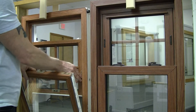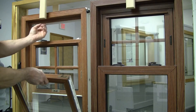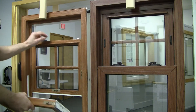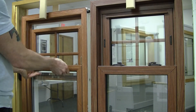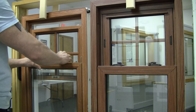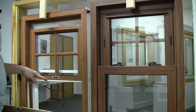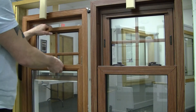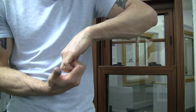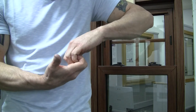Now, this window has six pieces of weather stripping. There's one piece up here but nothing on top. You have a little weather stripping on the sides, and at the bottom underneath you have one rubber bulb strip. One of the big mistakes — where they went cheap on this window — is there's no interlock where the two windows meet. When you have windows shut on a double-hung where the sashes meet, you really want those windows to come together with a nice deep interlock. All that window is doing is coming together flat — there's no interlock going on.